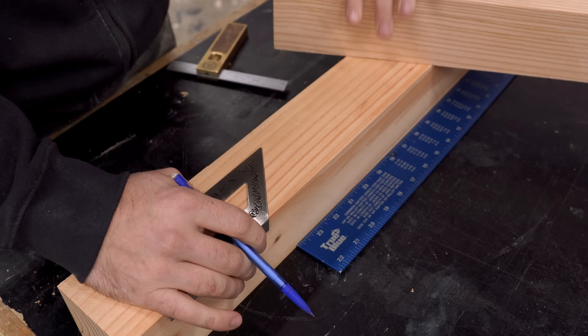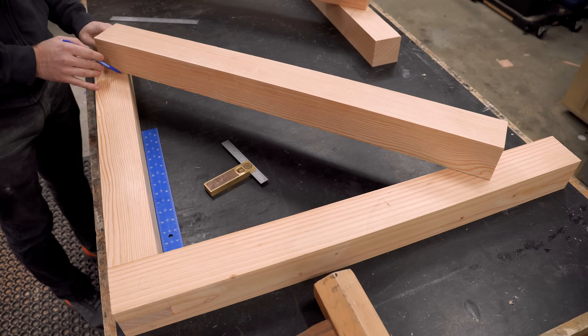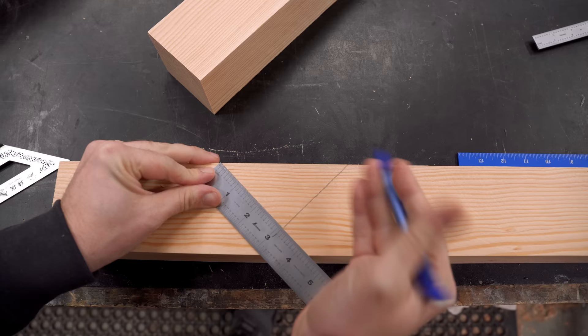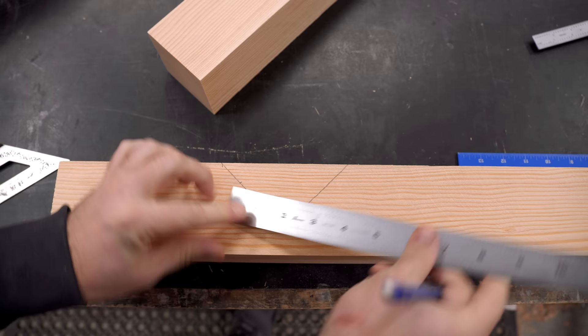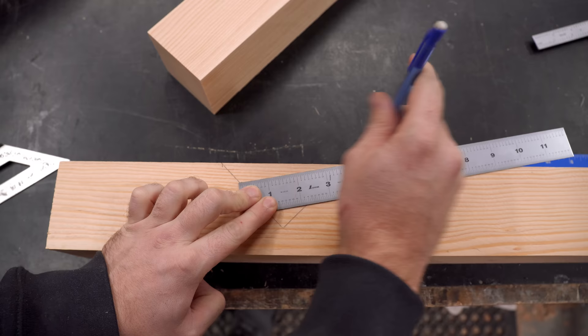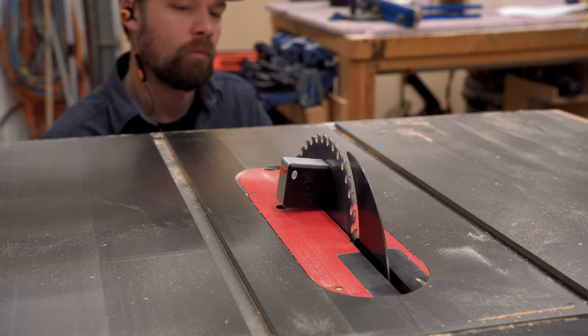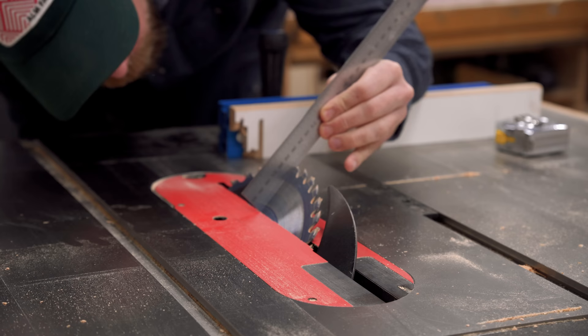I decided to keep things simple and set the braces at a 45 degree angle, and to get that angle right I'm using this Shinwa Japanese miter square. I'll admit I bought this thing because I thought it looked pretty - they're pretty inexpensive, like 20 bucks - but it's come in handy a lot more than expected. Shinwa is a brand I keep going back to; I think it's super accurate and really nice to use with both metric and imperial measurements. I don't want to notch these all the way into the post because that would make the post a lot weaker, so I just notch them in one inch and then drew a line up to where it meets with the rest of the post. This will give it an elegant look and also provide a bearing surface so there's something for that brace to rest on.